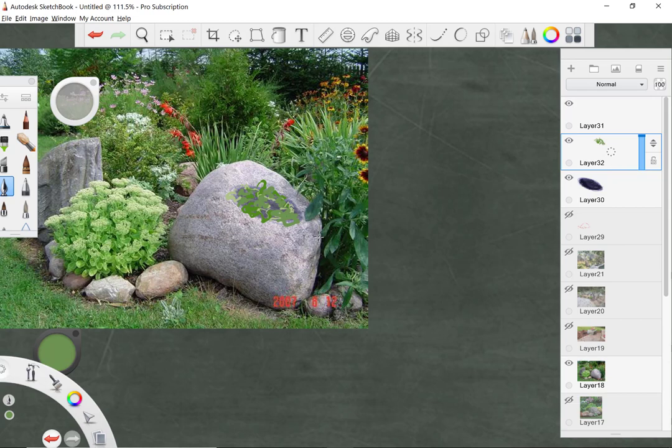Not only that, it's again adding more value to what's already existing in the industry as far as goods. So here we had a boulder. Obviously, that looks like a pretty heavy boulder. You're going to need a small bobcat to kind of bring it in, a little cherry picker or whatnot. But putting a planter pocket in there, now that requires another step in the industry. So the guys at the processing plant, they would have to core drill that out and properly till you put a drip line. Here's the other facet to the planter, is running an irrigation line through there. So now you could just have it tie into your sprinkler system. So, you take the foam, there's certain channels we can cut into the foam. We run a piece of PEX up there. Lots of different ways you can skin that cat. So, real powerful. I think that could totally be sold across the United States.